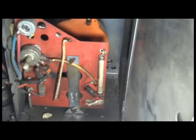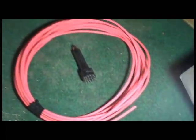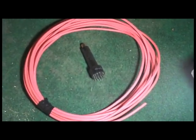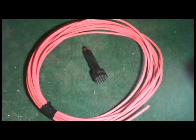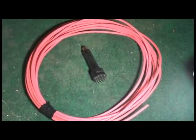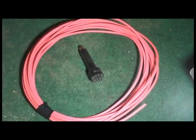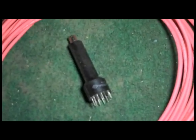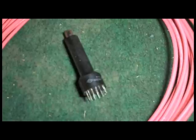I've come up with another solution. I do like to always fix these sets back to their original condition, but in this particular instance I'm going to go with something different. I ordered the wire — this red coil of wire is 40 kilovolt wire — which I would use to replace the filament winding on the flyback, because I'm pretty sure it's arcing through the winding to the core and grounding out. But also, when I called they had a solid state replacement high voltage rectifier tube which does not require the filament voltage.